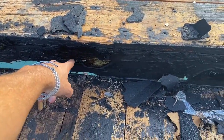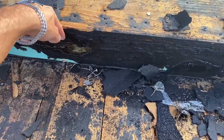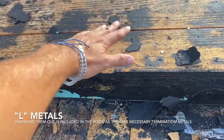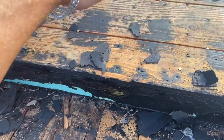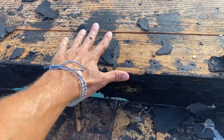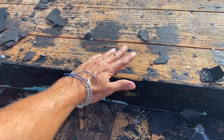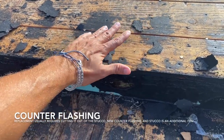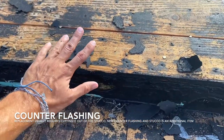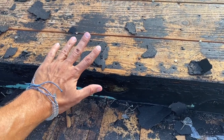Here's a piece of L metal. Changing L metal out is something that is included in the roof. Sometimes on a flat roof, if the roof is higher up, the L metal wouldn't reach all the way to the top, so you'd have an L metal and then a termination bar and a counter flashing. We do charge to replace counter flashing because it's usually embedded within the stucco, and the stucco has to be cut and replaced for the stucco metal to be installed.